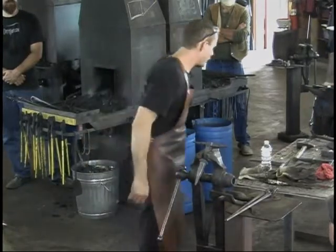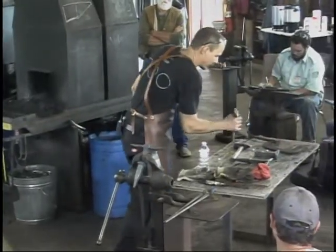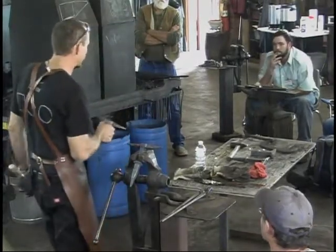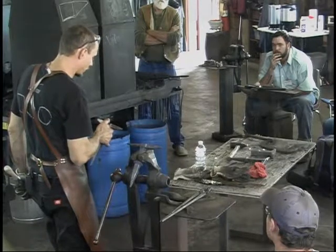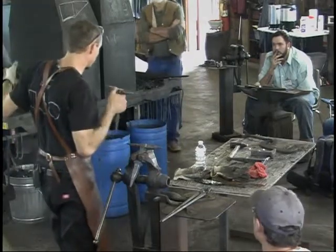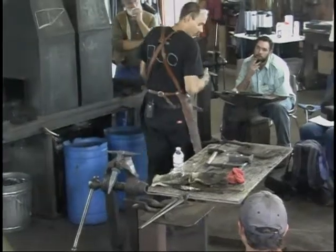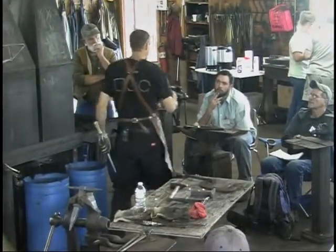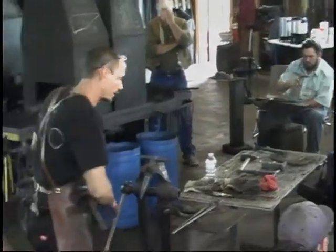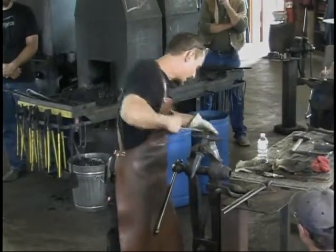There's also something funny in this, you can see it in these two pieces, handed around. I think this is in the rolling. I don't think this is a crack. It's on every piece of this track that I've gotten so far. There is a mark dead across the middle of the face. I think it's something in the rolling of the rails in the mill. When they rolled the rails in the steel mill, something there. So what I did with this one is I had to grind below that, until it was gone. Ground till that was gone. Okay. I hadn't seen that previously in the other ones I was making.